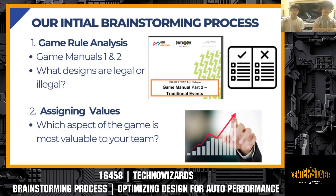The second point in our initial design process is really the most important one, and the one we focused on and benefited from the most last season: assigning values. This was completely new to us. When I say assigning values, I mean assigning importances and creating a hierarchy of specific aspects of the game that you find most important. For example, we really valued autonomous performance extremely highly because cones were counted twice and parking was the same amount of points as completing the circuit. So we wanted a robot that hit on every single aspect of autonomous in a reliable and efficient manner.